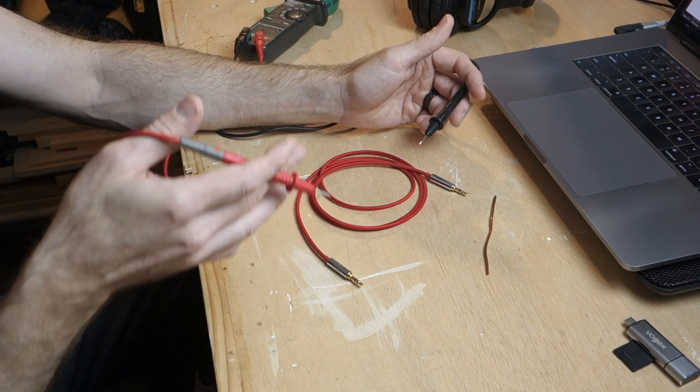For this cable and for headphones, we also want to verify that the conductor on one end is only wired to one conductor on the other end. This is how our headphone cable needs to be wired — one-to-one. And this is how almost all cables are wired unless otherwise noted. So if you buy a standard 1/8 inch audio cable from Walmart or Best Buy — they're labeled aux cables a lot nowadays — they are typically going to be wired one-to-one, and should be just fine for connecting your audio equipment without any of this testing.